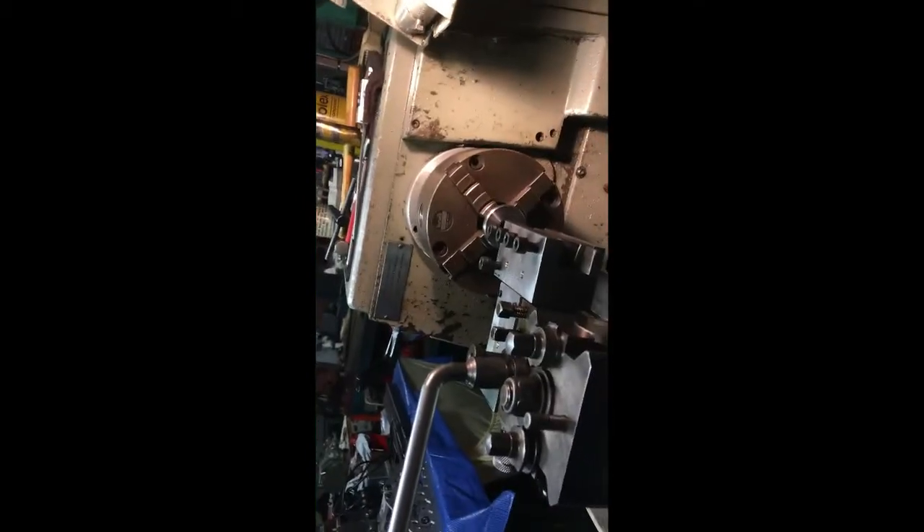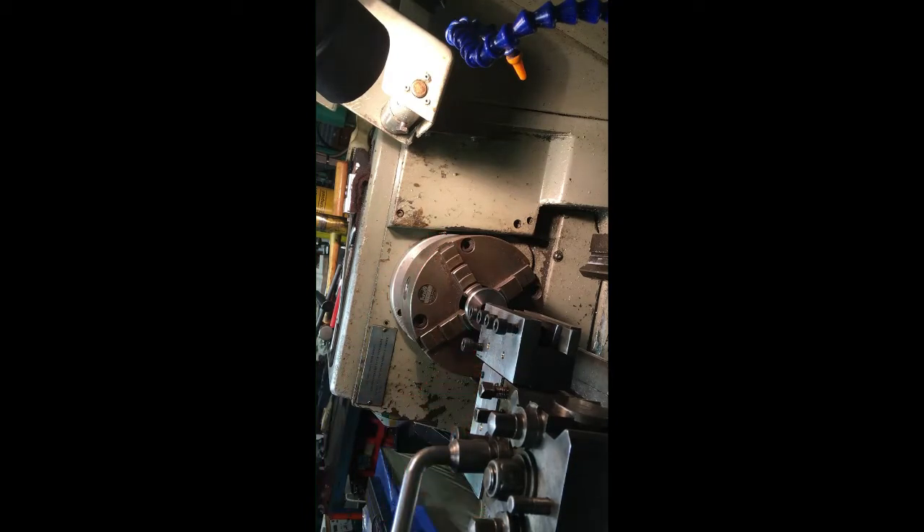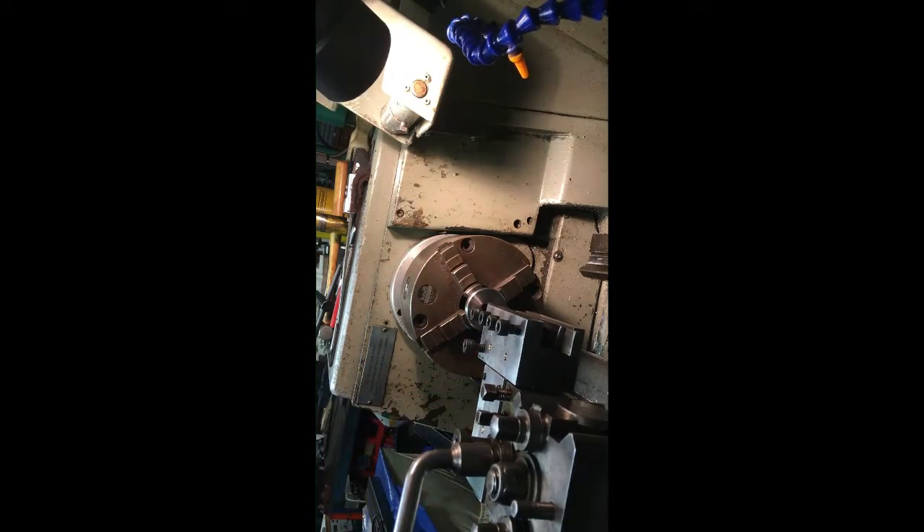Winding that back, and now at speed I know that it's set correctly. We've cut this at about 410 RPM. The beauty of this is that the cut is all in one direction, because I've been able to move the tool away and bring it back to the same stop, so I don't have to keep going back and forth on the Y-axis.